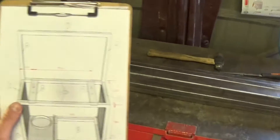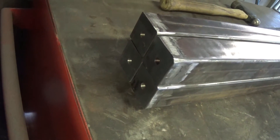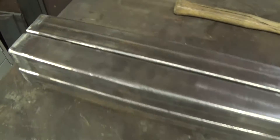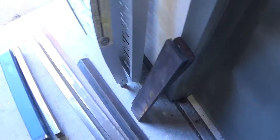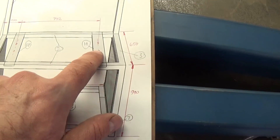Here are the four legs — the two long ones are the back and the two short ones are the front. I've welded on those little square 10mm plates for the adjusting feet and just knocked off the welds a little bit. I've also prepped the two top rails and notched them to suit the mounting plates. One is 20mm deep and one is 16mm, because that's the stock I had. I'll put the 20mm — the heavier one — under the headstock where all the weight is, and the 16mm at the tailstock end.